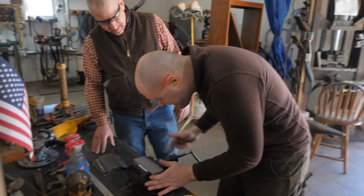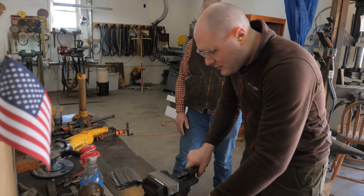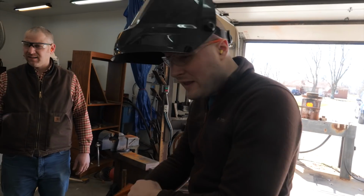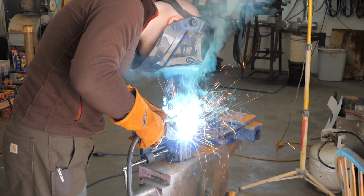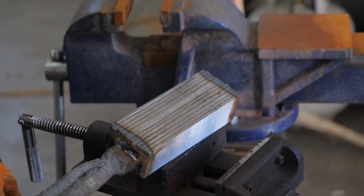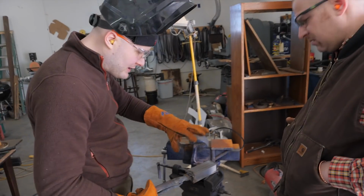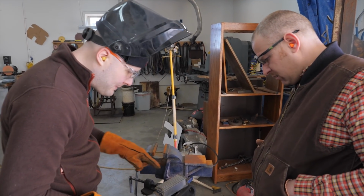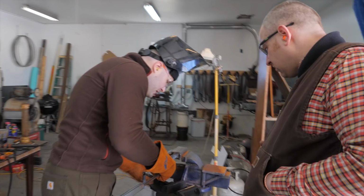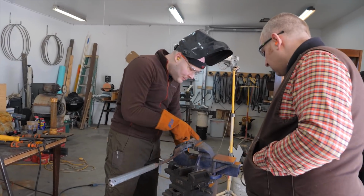Okay, finally we can make some progress here. All lined up, doing some welding, get some handles picked out. I'll weld the ends up first, stick the handle on there. I'm gonna grind these layers that are sticking up a whole bunch and get them a little bit closer to flush. That can close up when we start forge welding and leave some black lines in places that aren't lined up since that's wider than the 15 and 20 there. I'm gonna grind that down a little bit and I'm gonna run a couple beads across here.